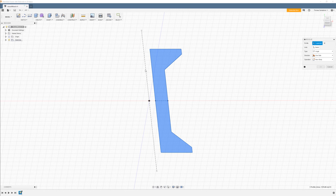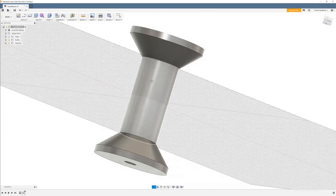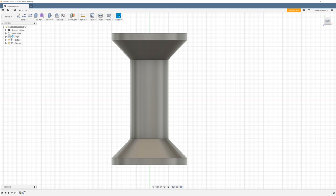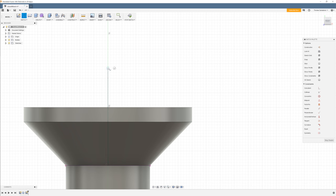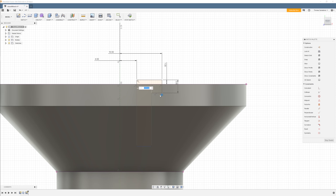In my case, the core is the actual spindle — the roller that the hose is going to roll around. I'm drawing that up based on the dimensions of that toilet paper core. You can see those lips on top and bottom that are going to keep the hose in place. I'm using 45-degree angles to make it more printable, and I've added the center bore specced to 5mm radius. I want to use a stainless steel 8mm smooth rod in here — basically leftovers from building a 3D printer — going all the way through the spindle. Next, I'm designing some bushing inserts that slip into that core cylinder to make up the difference between the 10mm bore and the actual 8mm smooth rod.